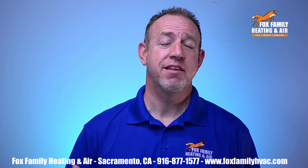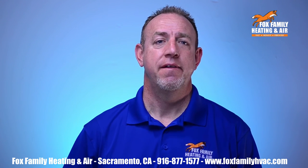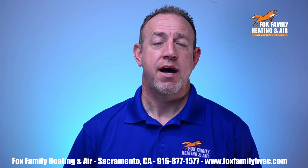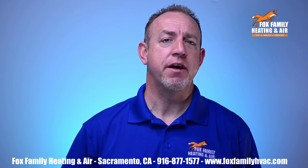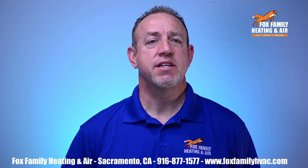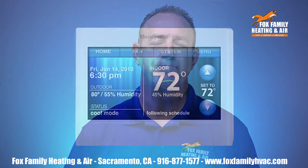Energy Star says anything above 50% indoor humidity in your house is considered high. It can not only cause added stress to your air conditioner, but the human body as well. High humidity in a home can make people struggle to get a good breath because of all the moisture that comes into the lungs with the air that they're trying to breathe in. Energy Star says 30 to 50% humidity in a home is just about right.